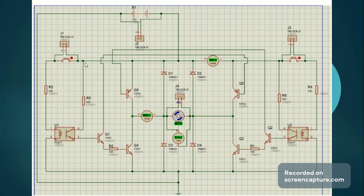As we explained earlier, we also used flyback diodes and placed them parallel to the TIP transistors, or the ones that are receiving current directly from the battery. So that would be Q5, Q4, Q3, and Q6. And these are in place to protect those components from overheating, providing a path for the current to flow. And when the circuit turns off, heat dissipation is not assigned solely to the transistors, because now with the diodes in place, they can also help with power dissipation.